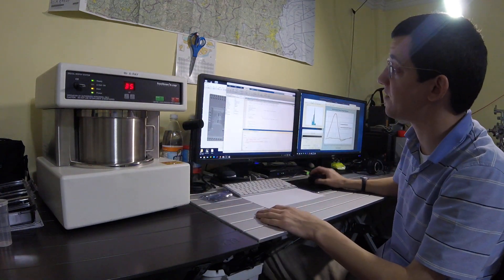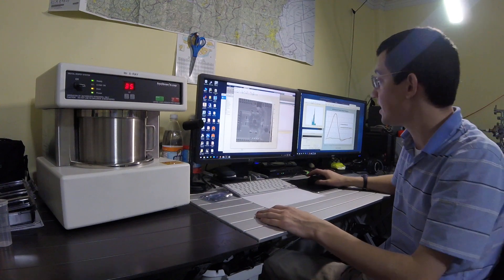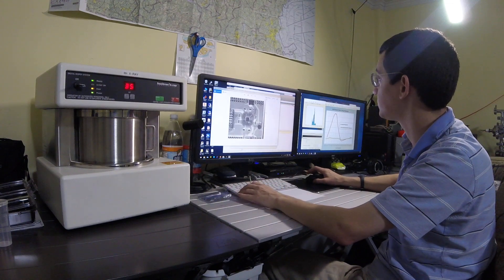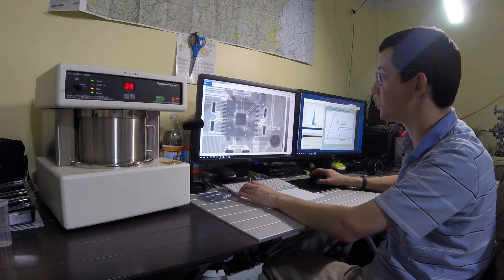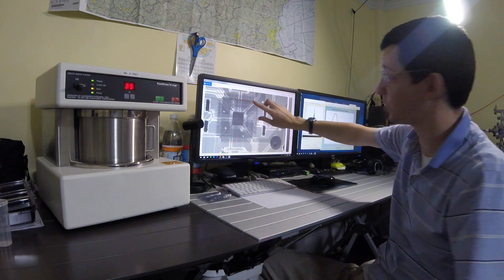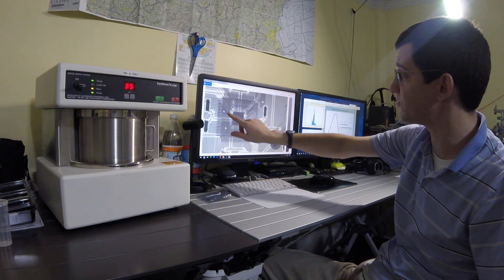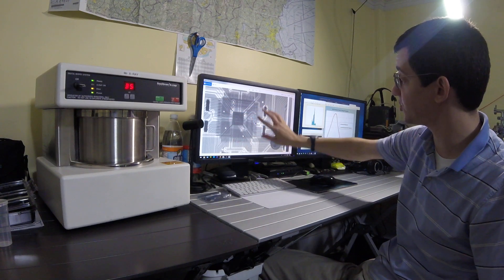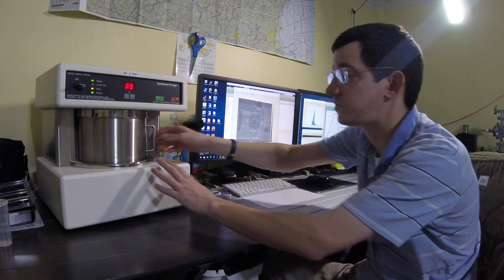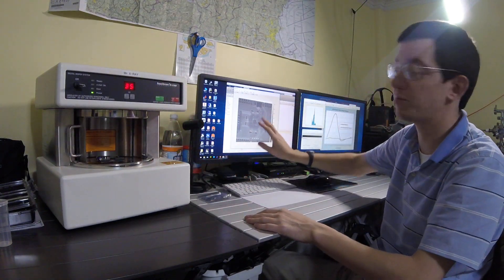Let's take a look at the image. There is the Altera CPLD — if we contrast-correct that, we can see what the chip actually looks like. You can see the outline of the surface mount package, the silicon die, the bond wires connecting from the metal pins to the silicon die itself, and then the solder and the traces.